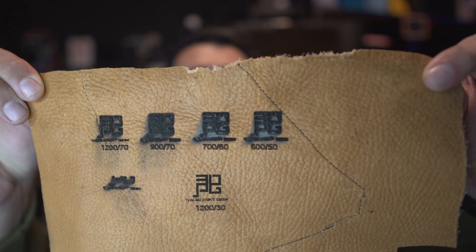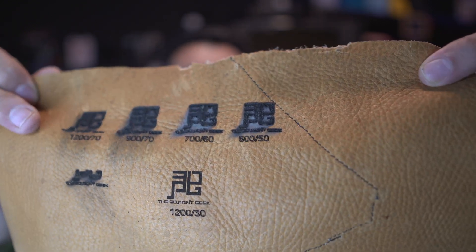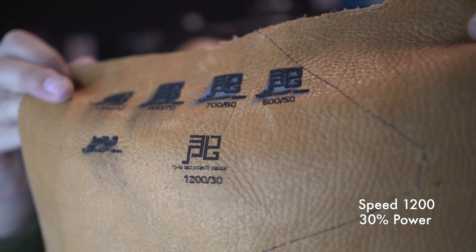Another thing I like to do is leather, and the proof that I didn't know how strong this laser was is the result. The ones on top I had done really slowly because I didn't know what to expect. In the end the best engraving was found at 1200 speed with 30% power, and the results are very similar to the 21–22 watt, 60 by 60 laser engraver I reviewed a little while ago. More or less the same settings but less than half the power — that's weird, and something I really like.